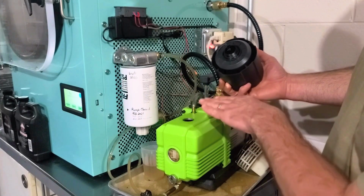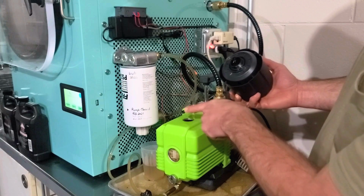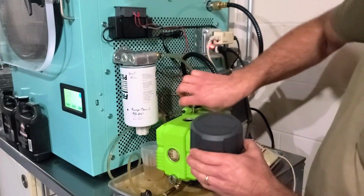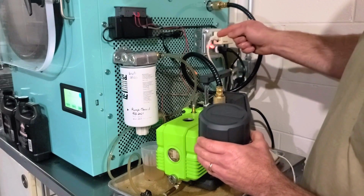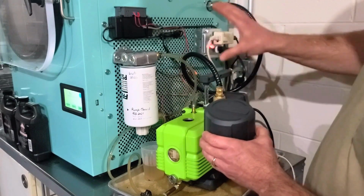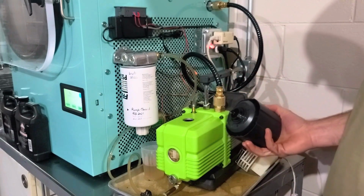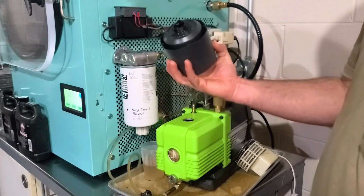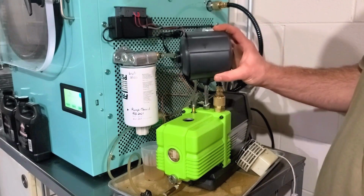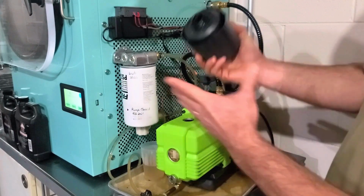The difference between the premium pump and the old pumps, you used to get a lot of vapor coming off. They have the tube coming out here, and when it started up, you'd get a lot of blow off and the oil would collect. So that was the reason why I put the tray underneath, because that was always a mess, that pump. So this filter comes on the new pump. It actually works out pretty good. You don't get the vapor floating around as much.